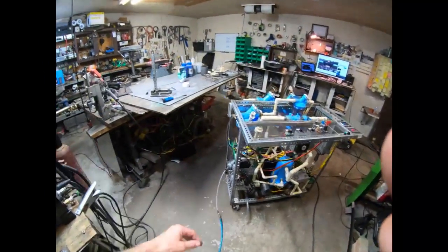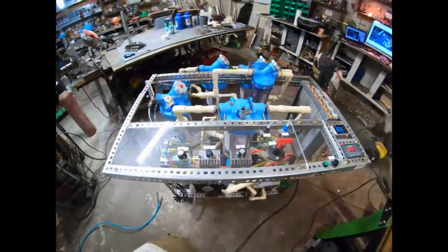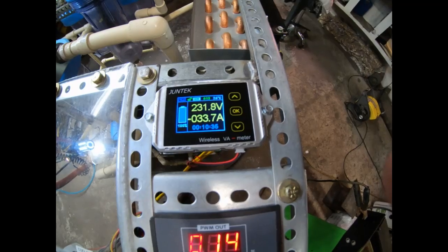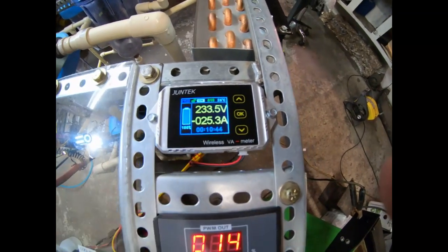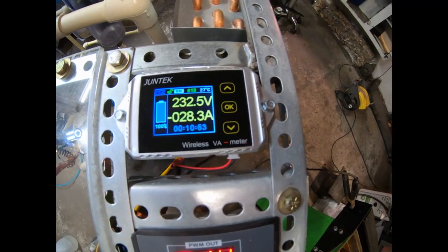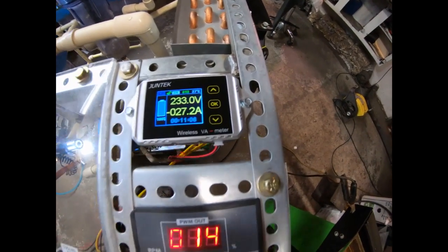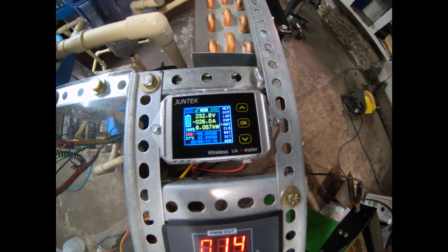High flow can also cause other issues when it starts to foam up really bad. This rotometer is inaccurate, so don't beat me up in the comments — we just want to look at something moving. Turning it on high — no sense in messing around. Turning the key on. It tops out at about 35 amps when it first starts, but polarization takes over and bubbles on the plates reduce the surface area. Now at 27 Celsius, running at 6.05 kilowatts.